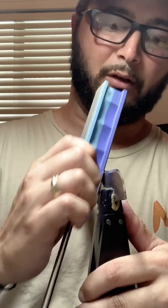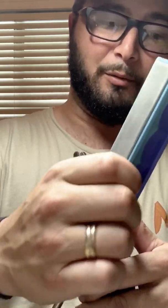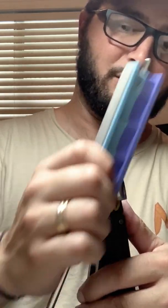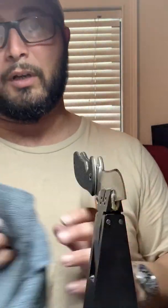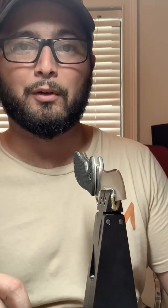So we did a reasonable job of getting rid of the 100 scratches, reasonable job of getting rid of the 200 scratches, reasonable job of getting rid of the 400 scratches, and worked our way up from there. 600 up, it's not too bad, but just realize if there was a 100, 200, or 400 grit scratch left, once you switch to 600, you're not getting it out. It would take a ridiculous amount of time to get it out with a 600 grit stone.